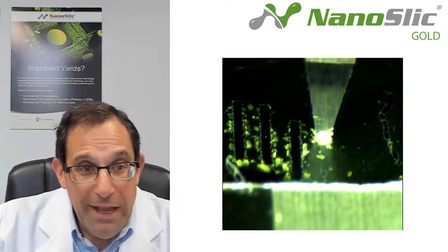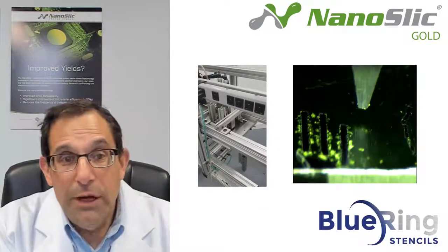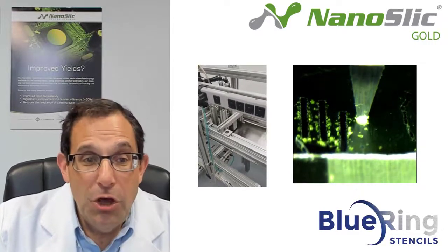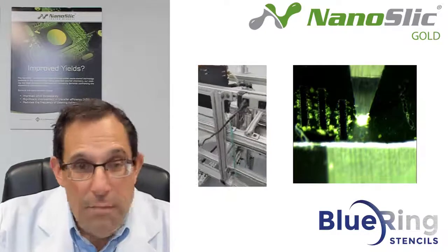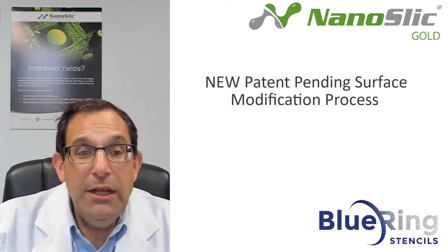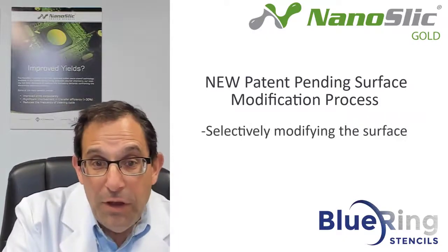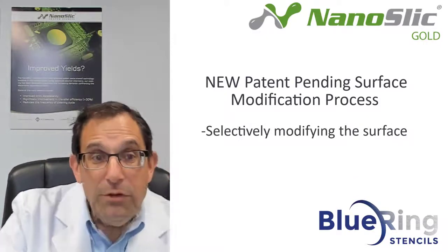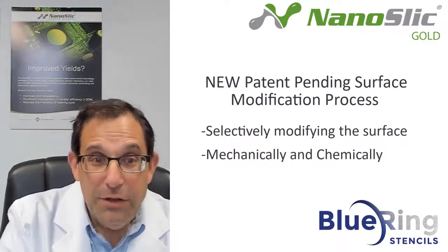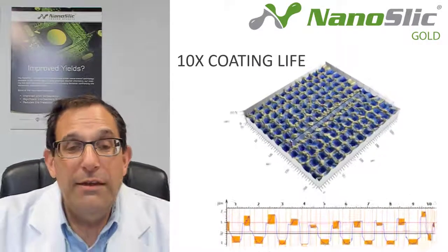Well, after almost 2 years of research and development using both the print simulator, which we talked about, and the micro scrape tester, we were able to develop a breakthrough coating technology, and it's a tremendous improvement. Our research has led to the development of a patent-pending surface modification process. By selectively modifying the surface of the stencil foil around the stencil apertures, both mechanically and chemically, prior to coating the stencil, we're now able to extend the life of the coating by as much as 10 times.